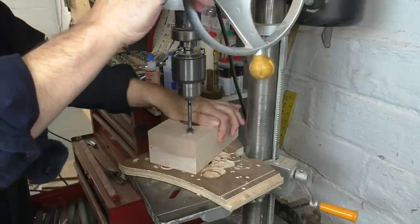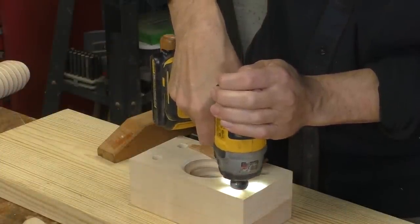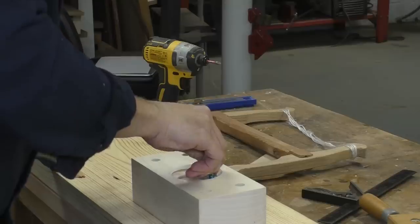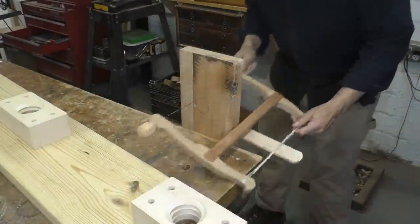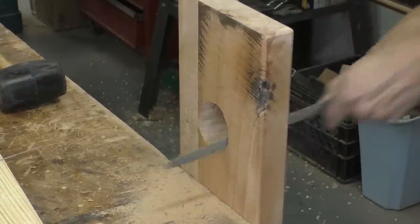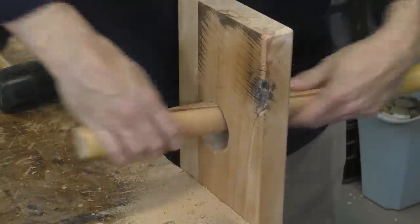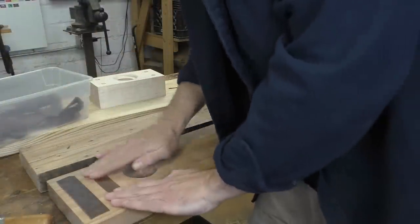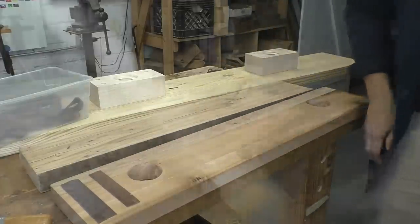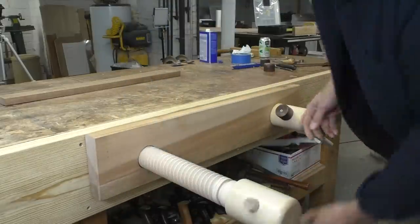The nuts that come with the Lake Erie screws are nice and thick, but that makes mounting them difficult. So I bore a deep countersink into each corner and drill through for my fasteners, then install the nuts with long screws. I sandwich everything together and transfer the hole locations, then cut out my final holes on the hardwood jaw and do a little cleanup with rasps and sandpaper. You need these holes to be big enough for the screws to pass through, but not so huge that the hubs on the screw can't grip the jaw — it's better to make them a little small and widen them gradually. A little bit of scrap leather glued to the inside of the jaws makes every vise work better, and it only takes a few minutes. Then it's just a matter of assembling it, threading in the screws, adding the handles, and getting to know the thing.